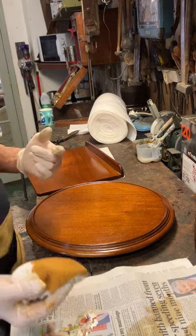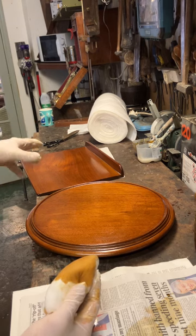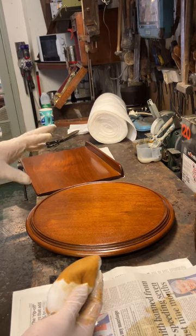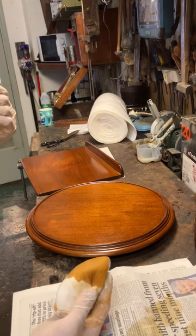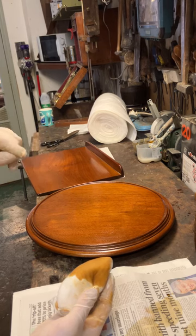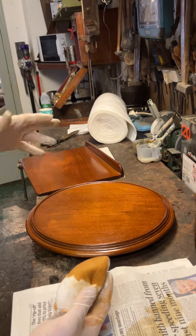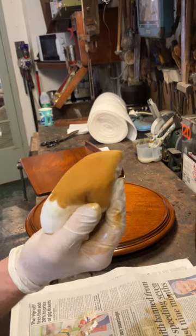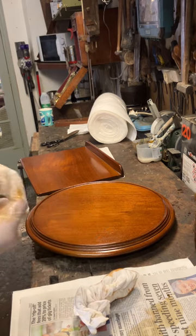Anyway, it was that simple really. You don't really want to watch me do this for another 20 or 30 times — it would be a bit boring. So I'm just going to do it to achieve the right amount of shine so the grain is fuller, then use my fine wire wool, wire wool and wax it, and then put it all back together. It was a particularly easy job because I brushed on the first three coats, then lightly sanded and wire wooled it, which gave me a head start — it means you don't have to put a lot of French polish on with a rubber. It's a little trick of the trade which a lot of people don't like to tell you about.